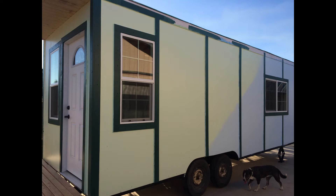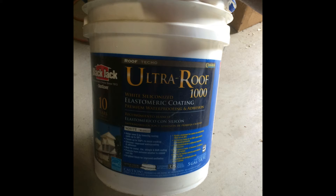For the actual roofing, I put 30-weight tar paper down first over the OSB, then put galvanized sheet metal across width-wise, and sealed the seams with a rubber coating you can get at Lowe's. There are two steps to this stuff: first is a thicker rubber you put over seams and any cracks or holes, and the second is something you roll on with a roller — the same elasto covering for flat roofs I used under my floor. It's rained on it a little bit and it looks beautiful, other than some dust and dirt smearing around.